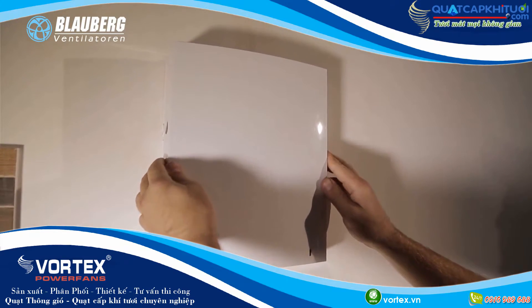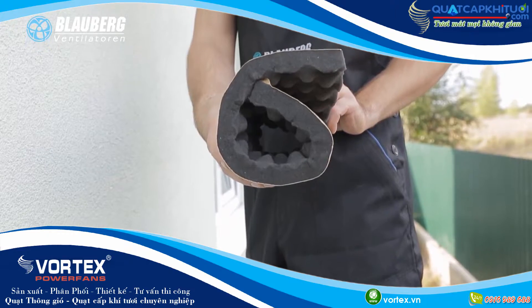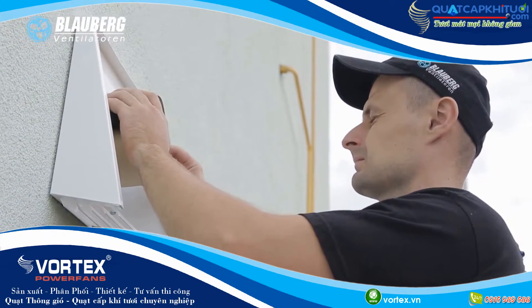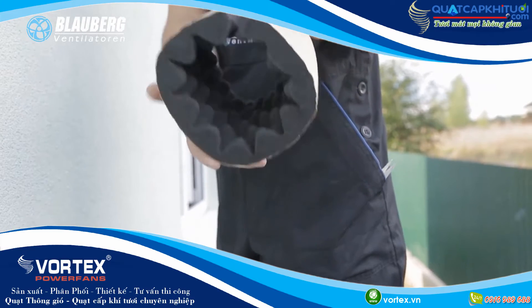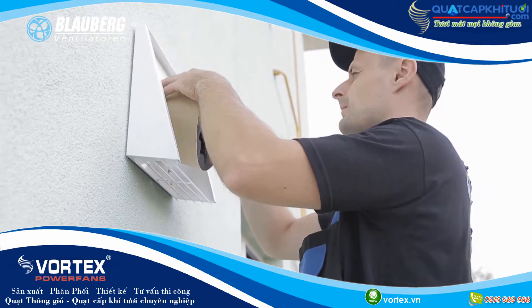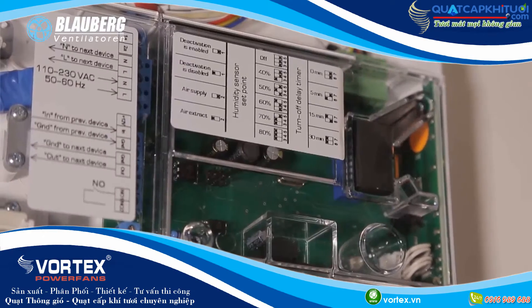Install the front part of the indoor assembly unit. Insert the sound absorbing material from outside. Roll the sound absorbing sheet to match the air duct diameter and keep the protecting paper layer outside. Push the roll into the air duct against the stop with the cartridge. Mark the roll to be flushed with the air duct, remove it, and cut the excess of the sound absorbing material. Insert the prepared sound absorbing roll into the air duct. Install the outer ventilation hood.